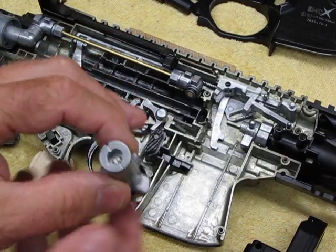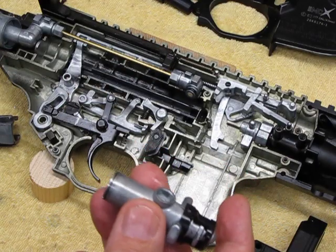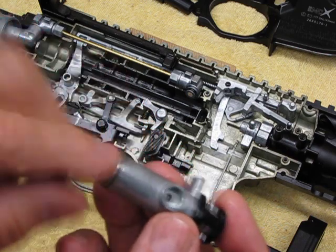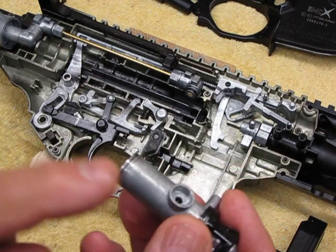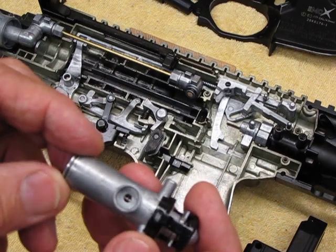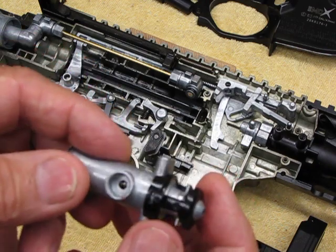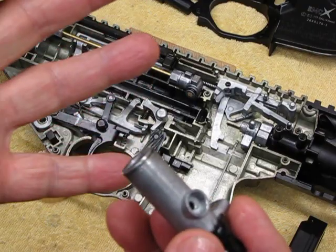See that little pin right there — it goes inside, releases the air, comes in here and blows out there. Pretty simple. That pin falls out first. After screwing around with this a dozen times, I looked at the seal and gasket and tried to figure out why it wasn't sealing. I smoothed it out with some 400-grit wet-and-dry sandpaper, put it all back together, and now it seals.